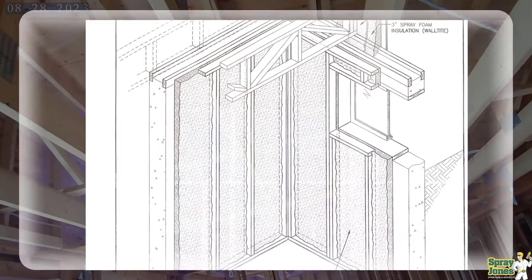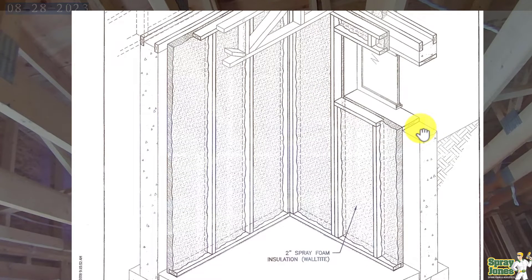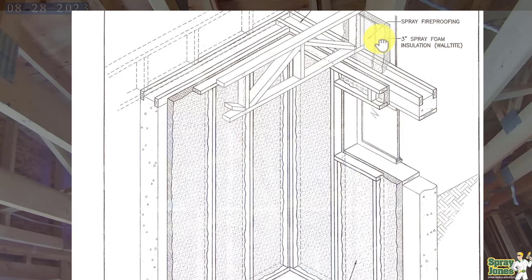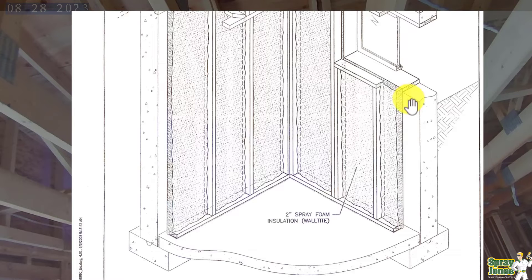When you look at these isometric 3D details, they show the requisite amount of spray foam insulation — three inches of WallTight. This is a basement detail with poured foundation walls, framing inside, two inches of foam on concrete, and three inches of foam up in the joist band. On the wall detail the engineers provided, no poly and no coating is shown as necessary — up against the concrete or on the surface of the spray foam. It is a standalone product, and the vapor permeance of two inches of foam on concrete is more than enough to be a vapor barrier.